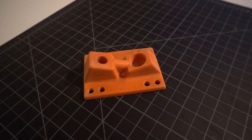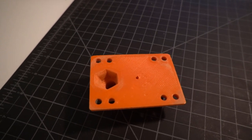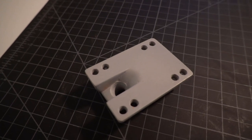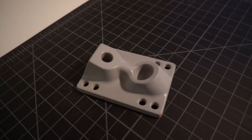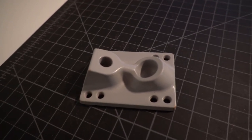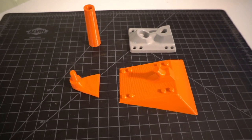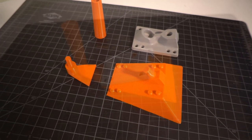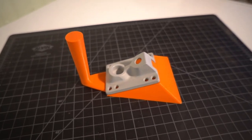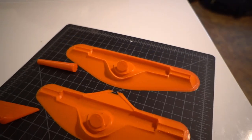In the last video I took a stab at casting a base plate and learned a lot from that experiment, so I totally redesigned my base plate to have less sharp edges, a higher draft angle, and less places for sand to get trapped. I didn't get it 100% right as you'll see, but it was a big improvement. For the base plates, the placement of the parting line isn't such a big deal, but the mold halves need to be pulled apart in a very specific way to keep the sand cavity shaped properly.